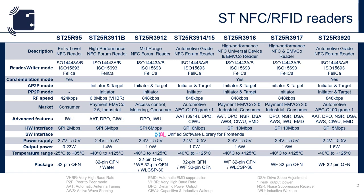The next one to the right is our ST25R3911B Full Featured Reader IC. It features up to 1.4 watts of output power and such options as automatic antenna tuning, dynamic power output, capacitive and inductive wake-up, and very high bit rate.